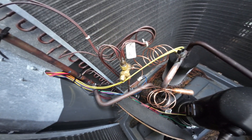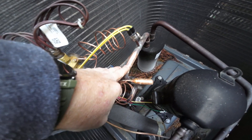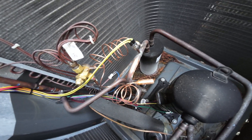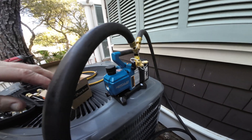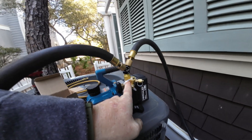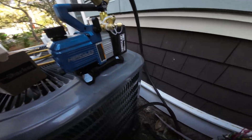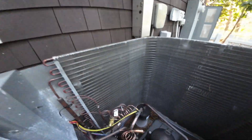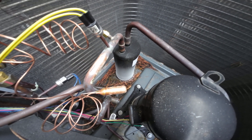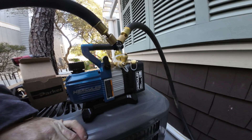It's really easy to swap these out, just bolt action. The other bulb came off so I gotta tape it and zip tie it - they didn't come with any bracket. My setup for this only comes with this bracket here, so I bought a Y off Amazon and I got two 3/8 hoses going into it. I did a nitrogen purge - this thing has an accumulator so you can still see the ice literally in here, so it's gonna definitely struggle to pull a vacuum and it's really gonna be a test for this little Hercules.